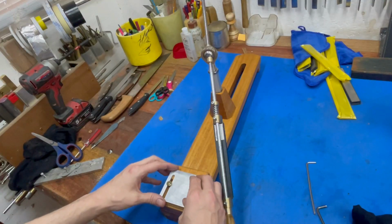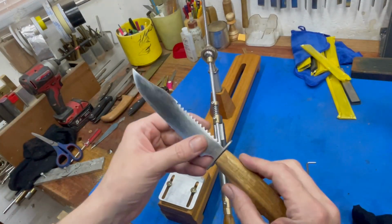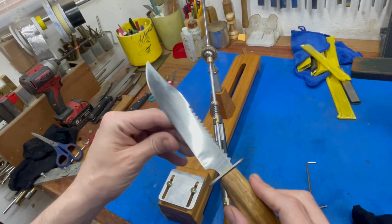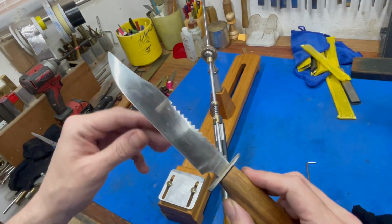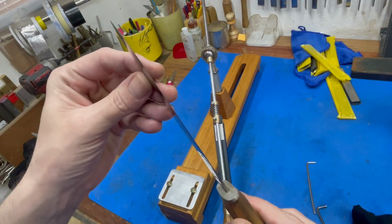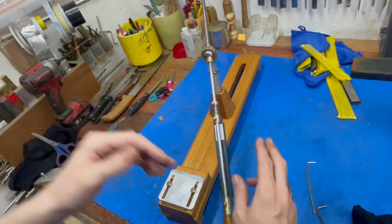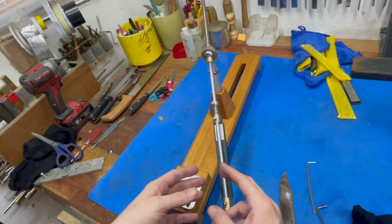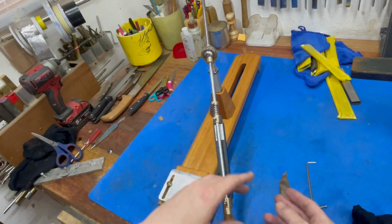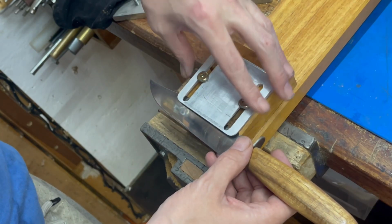Nice, right. So, I want to sharpen the knife that I made, because when I made this, I didn't necessarily make it sharp. Each side has got one big massive bevel on it, as you can see. So, let's sharpen this. I'm just going to go through the grits, 240, then probably 800, 1600, and so forth, till we get to the point where I'm polishing it.